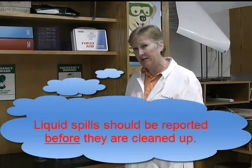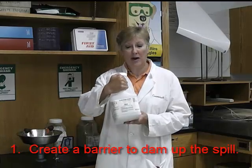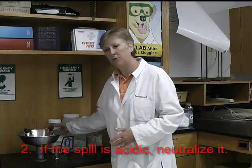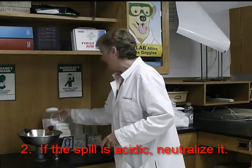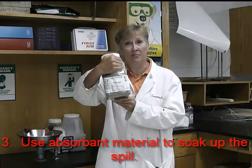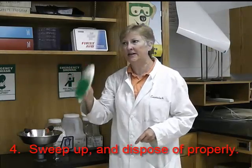The other thing over here is for liquid spills — it's a three-step process. Step one: use the sand to make a dam around the spill to contain it in a certain area. Step two: if it's an acid, use the acid neutralizer; if it's not an acid, you skip this step. Step three: use an absorbent to soak up the liquid. Finally, use a dustpan and broom to sweep it all up — that takes care of the spill.